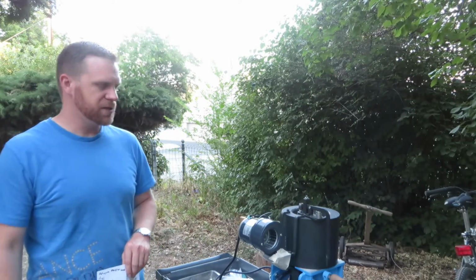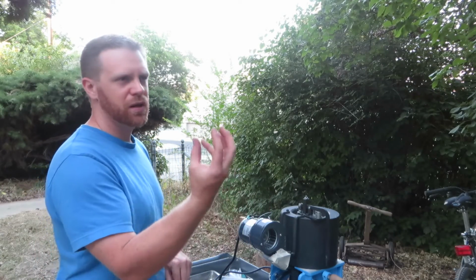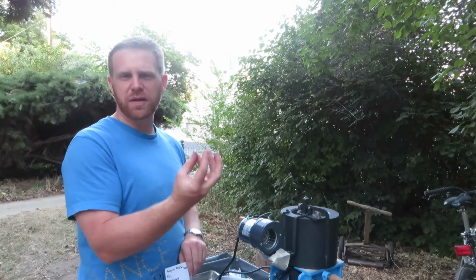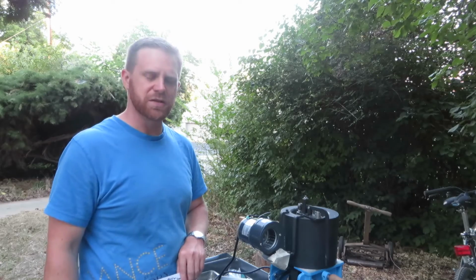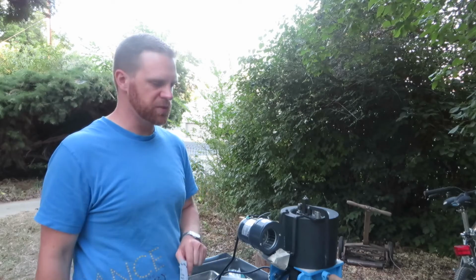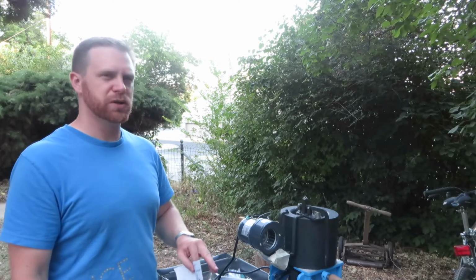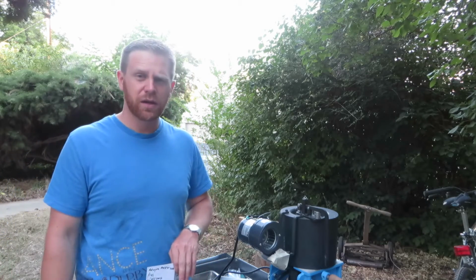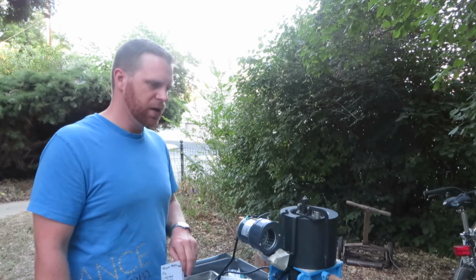Well, it makes a lot of things more consistent, so it's holding the mold more consistently. Because you're not busy holding things up, you can pay attention to the exact moment that it frosts. A lot of your motions can be faster. You're not having to stop and break the sprue plate or turn the mold upside down, so that aspect of it goes faster, which gives you much more efficient casting with the 2-cavity mold than most people can do by hand, but about on par with what you could do with the 6-cavity mold.